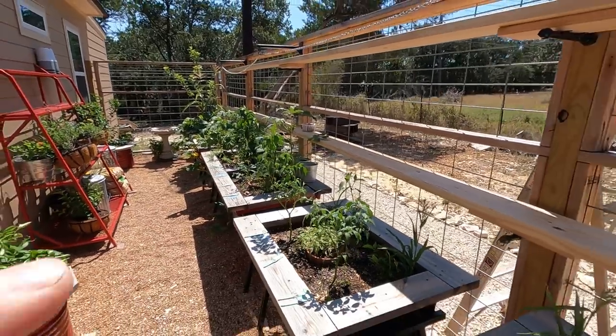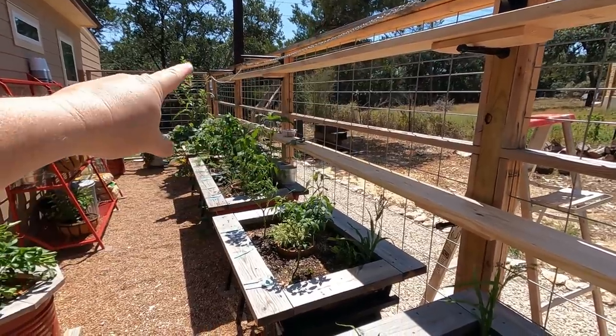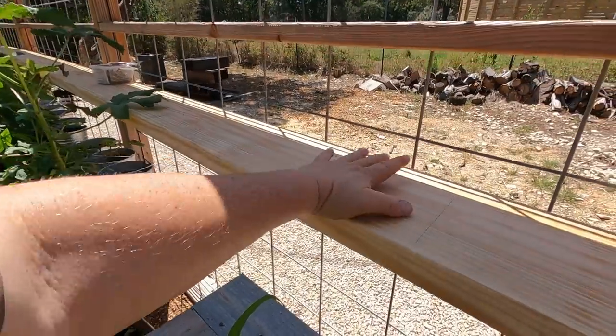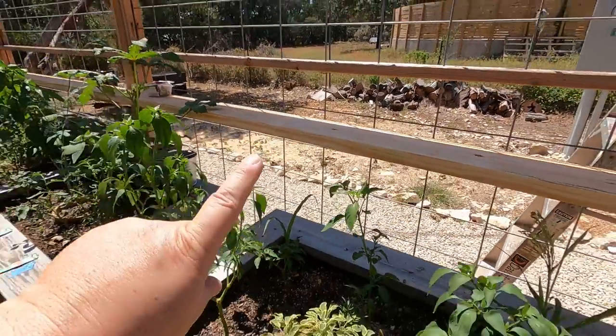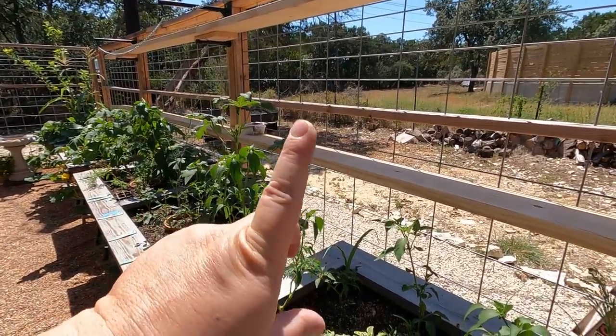You'll notice that board down there, it's a little warped. They're in line and stuff like that. And because they are 2x material, even though they're 2x8, there's going to be some flex as you put weight on them. So that's why I bought those extra 2x4s. Let's turn these into some I-beams.